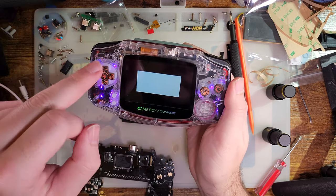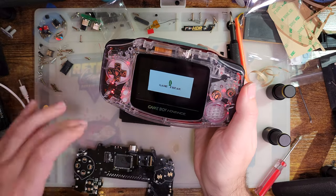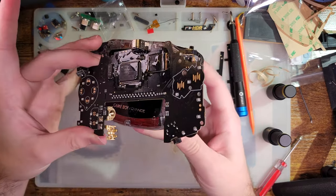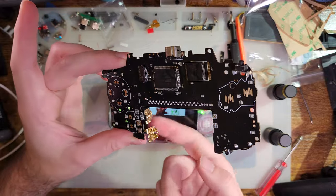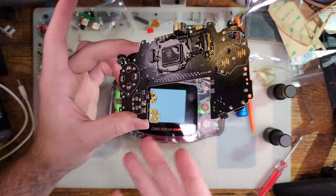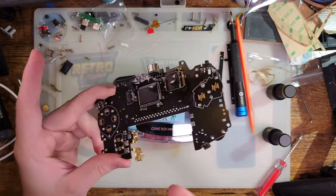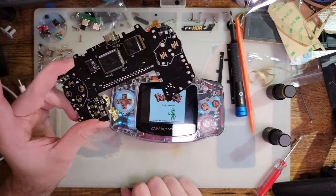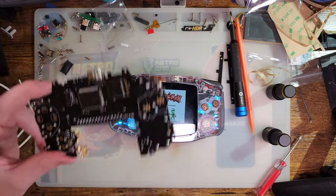And one of the things, I don't know if they took advantage of this, but I did notice when I tried these boards out in advance, I plugged it into power and tried turning it on with no CPU to see what would happen. We just got a power light, nothing else came on, no RGB, nothing, which makes sense, lights are on but nobody's home sort of thing. And as soon as I dropped a CPU on there, I started getting the RGB stuff.